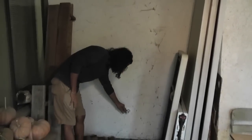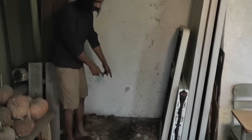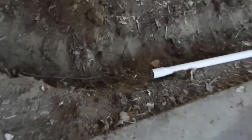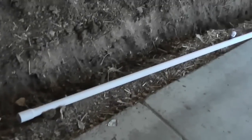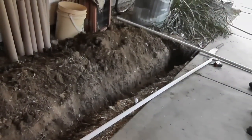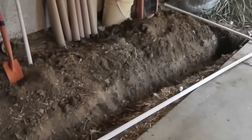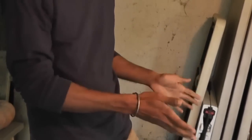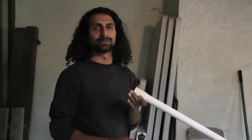The pipe is through the wall and we've dug a trench starting at the wall going along our walkway entryway. We actually tunneled under the walkway, and the pipe is going into the garden to the right of the walkway. Now we're going to glue all these pipes together, connect to the pipe coming out of the wall, and we'll be set up. We already showed you how to glue PVC — same process here, just with longer lengths of pipe.